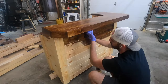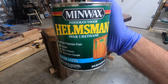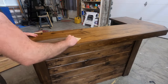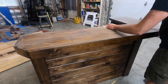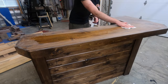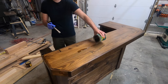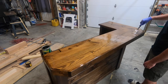I'm using a combination of Minwax honey and dark walnut for the stain finish. For the clear coat, I'm using spar urethane — a satin finish — and I think the satin turned out really well and blended in perfectly with the look of the stains. In between coats I sanded with 400-grit sandpaper and then used mineral spirits to wipe all that off. I should probably be using gloves here, but I also like to live dangerously. Here's a look at everything that came off — that really is an important step. Between coats you want to sand everything to get the bubbles out, and on that final coat really slow down and take your time to get a good finish.